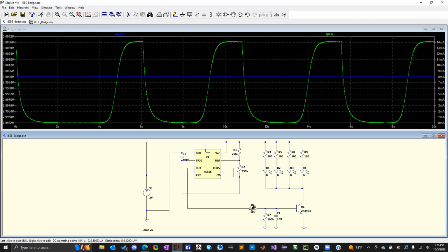Yeah, okay. So I had to lower that resistance at the base current of the transistor because I needed more current to be pulled through the LEDs, because we are only getting about 4 milliamps, and they're rated for 15 milliamps. So now we have about 14 milliamps going through each of these diodes, and then we have 3 volts from the battery. As soon as you throw that nickel battery in, it should blink on really fast, and then slowly turn off for about 3 seconds, and then turn back on, and then turn off and turn back on. That's gonna give it its glowing effect, right?